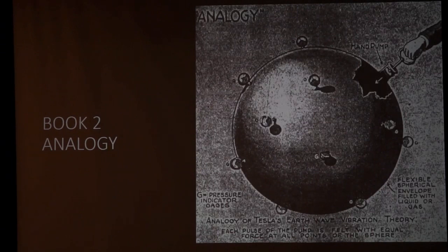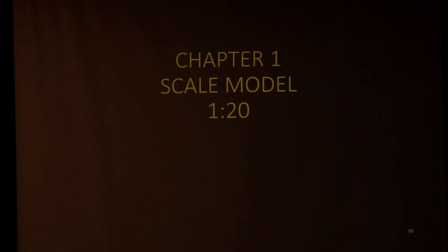Now we've got to build a scale model of it. It's not as easy as it sounds. We're going to make it one-twentieth. It turns out that if I made it one-fortieth or one-thirtieth, the scaling factor collapses on itself — the same thing as in the musical scale, which is why you need equal temperament. If I went one-to-ten, it would land on a new ham radio experimenter band where this thing has actual application as a communications device, but then it's too big to fit in the back of my car. So it had to be 1:20, and that landed me right smack in the middle of the AM broadcast band. So we decided to use it as a crystal radio and receive AM.